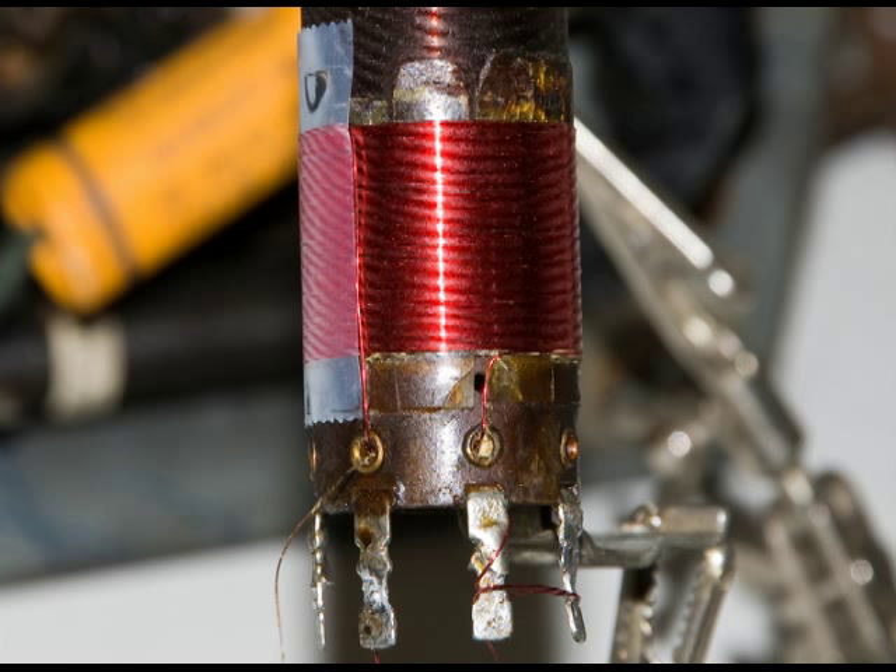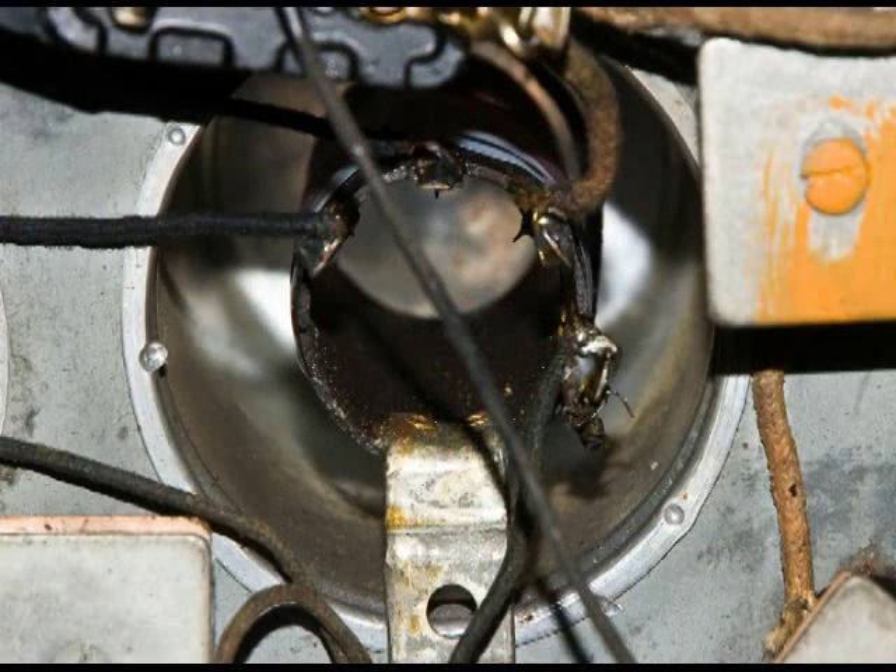Here I've just completed winding the new coil on the form. The next thing I did was tape the windings — I want to do that to make sure they don't come unwound. Then I soldered the leads onto the form. Here the coil has been reinstalled and everything's soldered. I've checked it out with an ohmmeter and everything is ready to go.